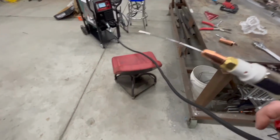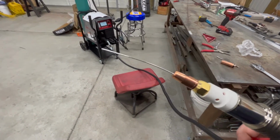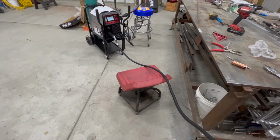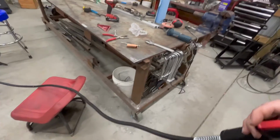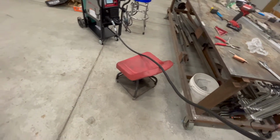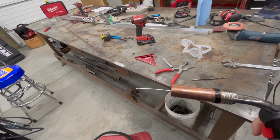I mean, I haven't welded with it. That'll be the real test, but just getting it out through here, I can feel it running through, and I felt like it hit a little spot down here, maybe. It was very faint. I'm like, oh boy, it's rat's nesting. But no, it fed right through, popped right out. Interesting thing, I've never MIG welded like this with aluminum, only ever used the spool guns. It says right in the manual, you've got 035, you need to use 040 tips. Sorry, camera work is not good today. So yeah, it's an 040 tip. There it is. Cool beans, I'm excited.